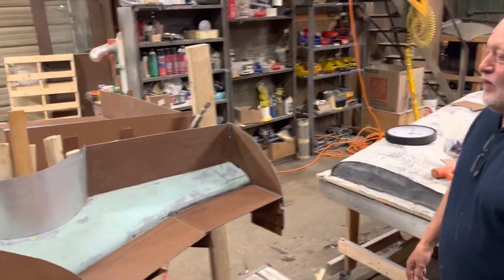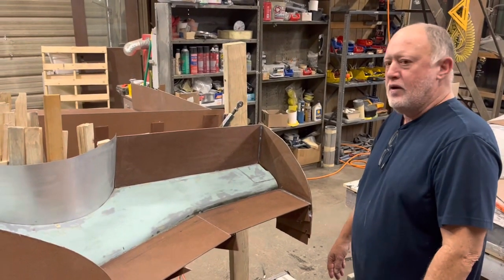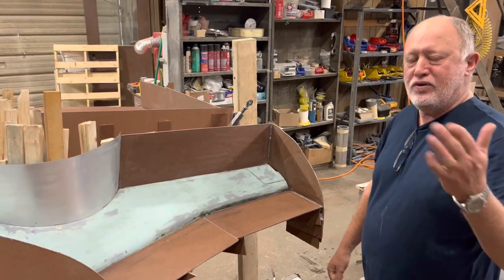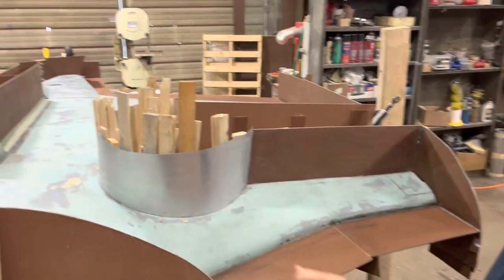What are we doing? Well, once we're all waxed and ready to go, we'll get the PVA down — polyvinyl alcohol. And for those of you that don't know, the only thing that's going to dissolve that stuff is water. Nothing else will touch it. You'll make a whole lot less mess if you spend the time just to peel it off.